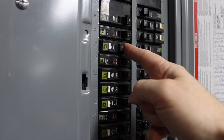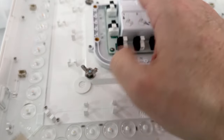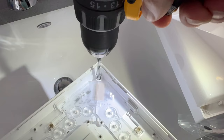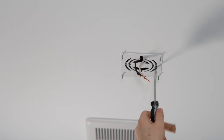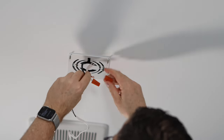You'll start by turning off the power and then removing your existing light fixture. Next, you'll take the panel from your Smarter Kit that has the wall bracket. This is a step that I originally missed — it was confusing when I opened up the panel and couldn't see the wall mount referenced in the instructions. To open the panel, just pull out some plastic and use a screwdriver to pop the diffuser off. For just the first panel, you'll need to drill four holes through the plastic on each corner. Then pull the wires through the bracket and attach the bracket to the ceiling. You then need to connect the included cable to the white and black wires from your ceiling.